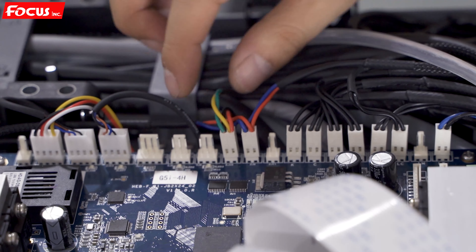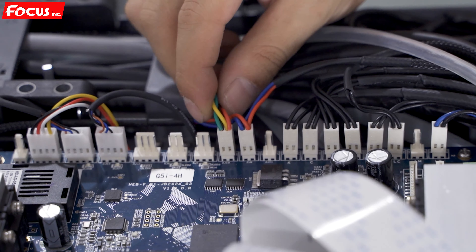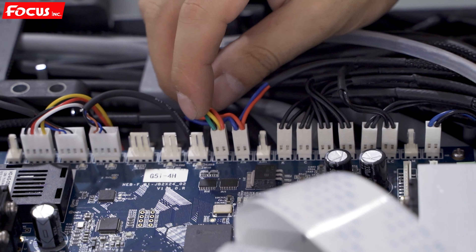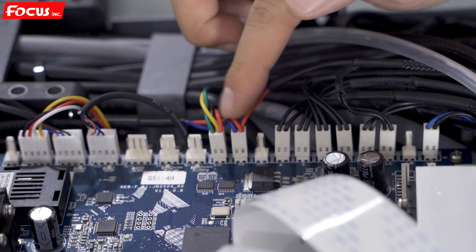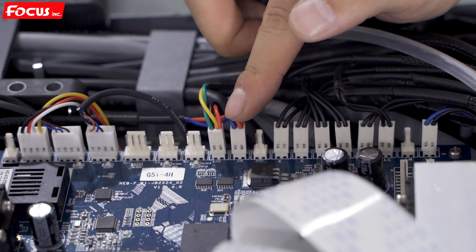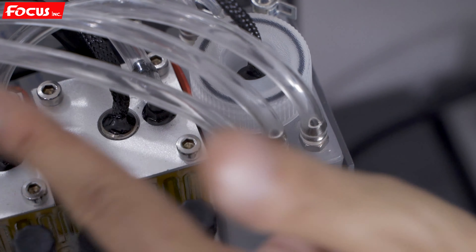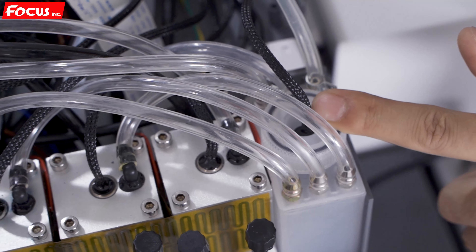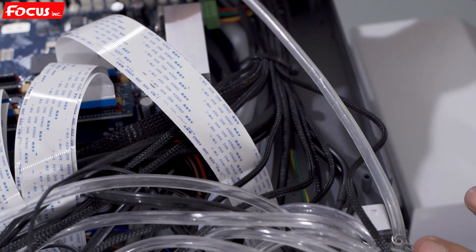This cable is for the anti-collision system to protect the carriage and print head from scratching. The signal plug for the anti-collision system is installed at the left and right side of the carriage. This pin is for the front left and right plastic air tank level sensor. It is used so that once ink goes back to the air tank, the air tank will send a signal to the board, which will then stop pumping ink and air to protect the ink supply and air pressure system.